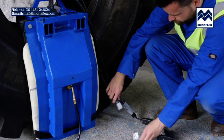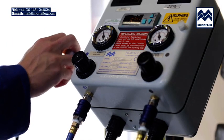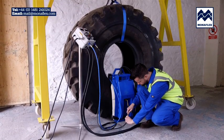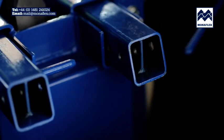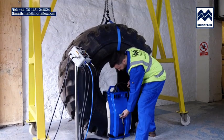Disconnect both the inside and outside heat pads. Close the incoming air tap and then exhaust air from the airbags by first pulling the slide air valves to the off position, then disconnect the quick release couplings from the airbag hoses. When the air has completely exhausted, remove the locking pins and remove the OTRS assembly from the tyre, leaving it ready for the next repair.